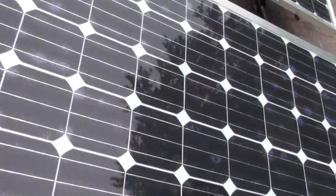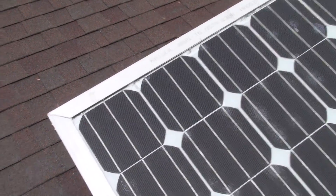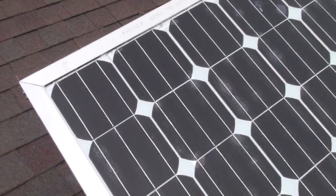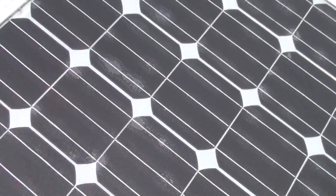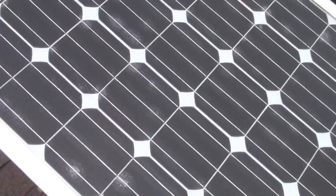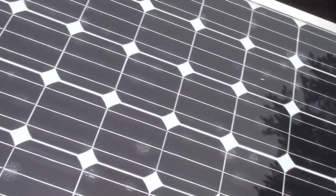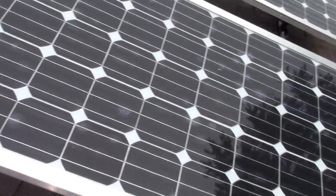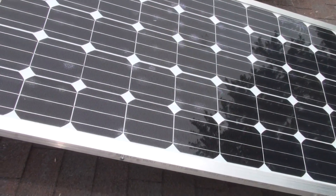One thing on this panel — I didn't check before I went to put it together and I forgot to alternate every other row. So after it was all laminated really nicely, I had to run a wire up from each row to the other end in order to get my circuitry running the right way. I was preoccupied worrying about the oven and I completely forgot about inverting every other row. But you can still go around that and run wire up the outside if you have to.